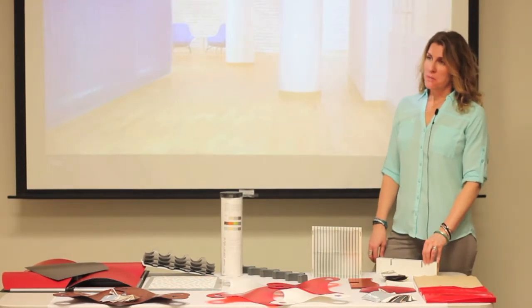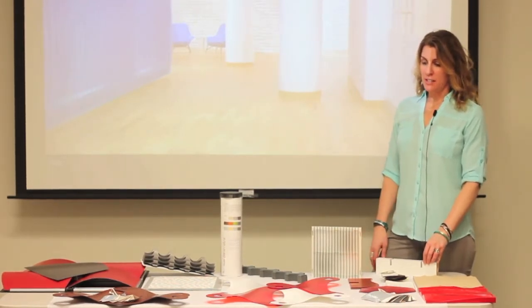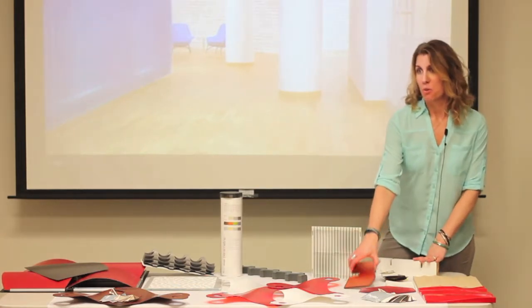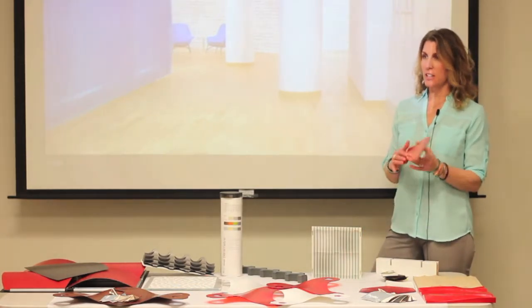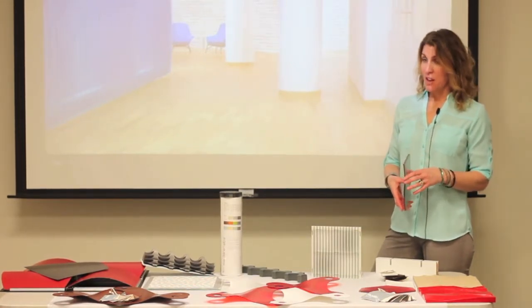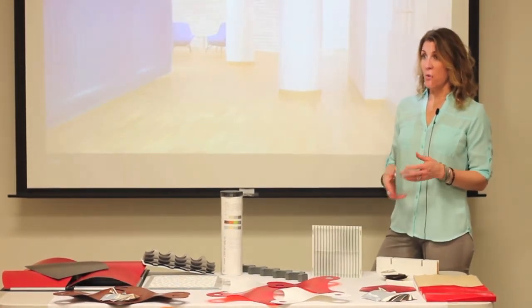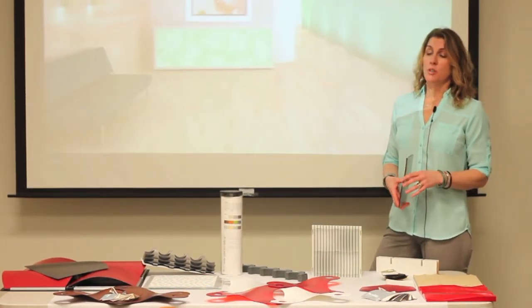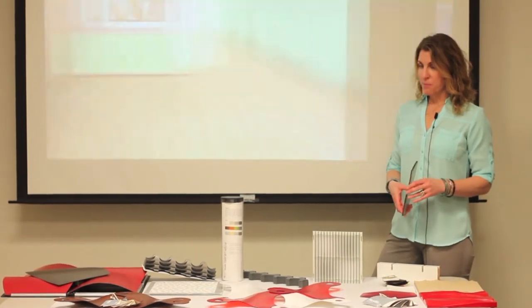So Edge is a 3-dimensional feature that utilizes the 3-form Varia Eco Resin panels. Varia Eco Resin, we usually start with 1/4 of an inch, and it is a PETG laminated product. We laser cut it into fins that then can be installed as a wall feature to dress up a long corridor, to add interest to a lobby space.